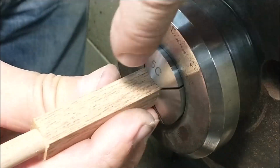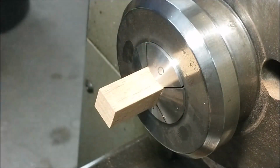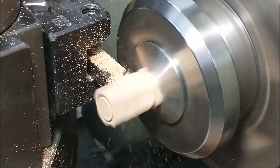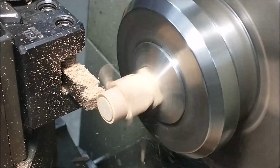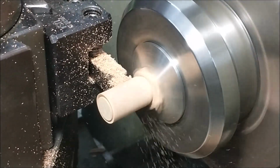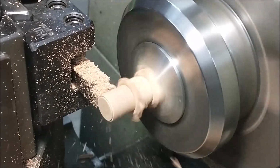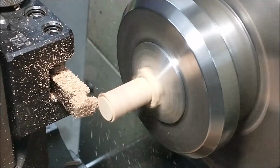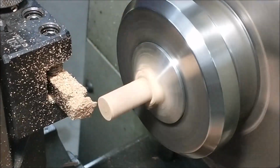Regardless of the material that you're cutting, it's always a good idea to keep a common surface in line with the feature on the collet. So the 5C marking on the face of the collet will always be in line with that same face on that wooden block. If for any reason that collet was not cut true initially, the axes or the center lines of these end features would not be in line with each other. They would not be coaxial. And if it was a precision part, that'd make a difference. But it's a good habit, so pay attention to that.